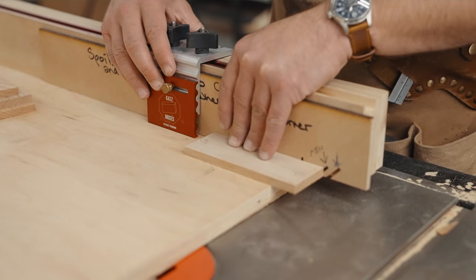Our trays are fitting perfectly now. A piece of advice: trays only get tighter as you put finish on, so you want them to be kind of tight at this stage but able to fall out — you should have to push them in but not pound them in. I was able to keep my grain match; we lost maybe an eighth of an inch on the grain match, but it's pretty close to perfect.